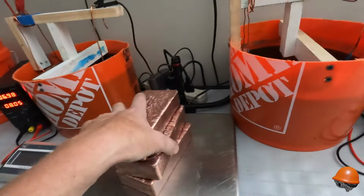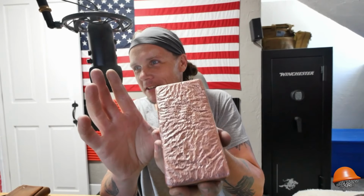That's a beautiful thing. All right, closer look time. Look at these chunky monsters, man. Nice brownie backs like we like to see. And you can tell, man, when you're pouring pure copper, it's like liquid. It's like water. You don't need to add a bunch of flux and borax. You don't need to do any of that. There's nothing floating. You don't have to skim anything. It is clean, clean, clean. Right to the last drop.